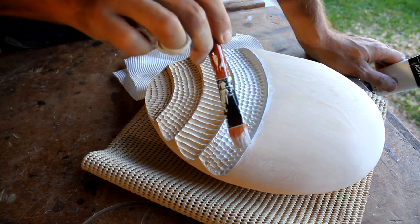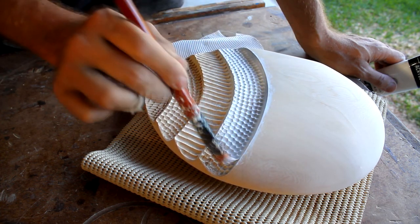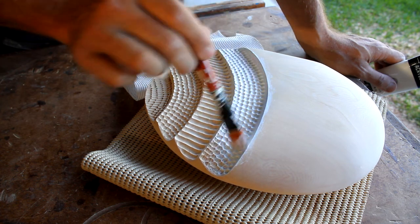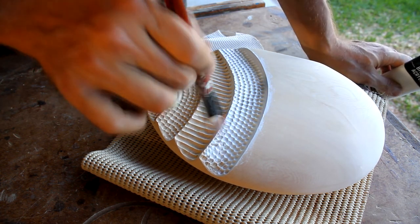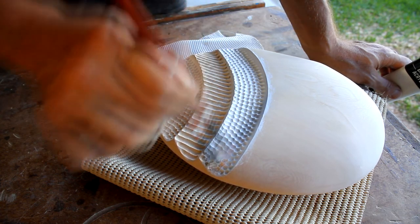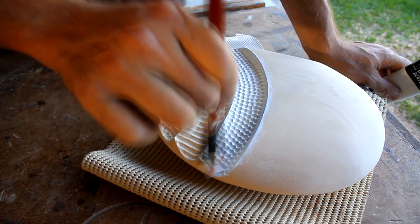Otherwise you can finish this with a stain. Sometimes I like to use Brown Japan or Black Japan. They're two colours we have here in Australia by Feast Watson. They're spirit-based stains, so they soak into the wood really well, and it's really hard to bugger it up. The bad thing about it is you must have a really, really good finish, otherwise it'll show up any little marks.